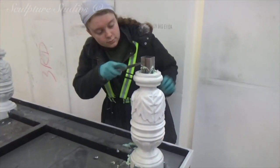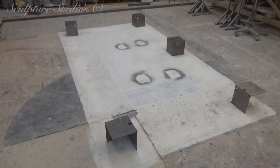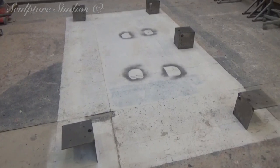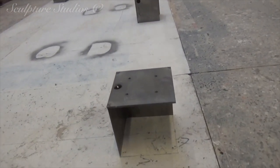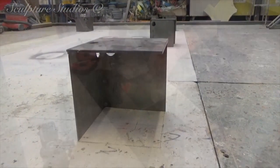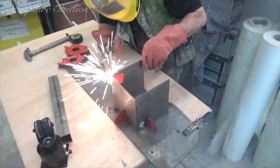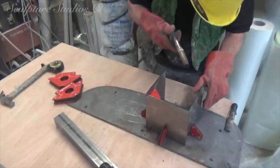We're simply securing the fibreglass shell to the metalwork leg with a polyurethane expanding foam, and this fills the entire space inside. To install the casters we're creating custom-made open steel boxes. These will allow enough room for the swivel of the wheels, allow the air system tubing to be installed and run from leg to leg, and will be strong enough to support the entire weight of the table, the zebra and any actors on top when this is all dropped to the floor.